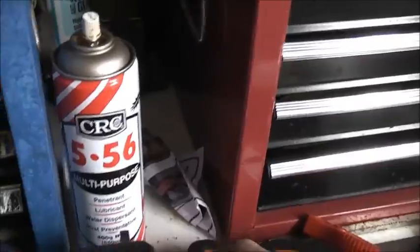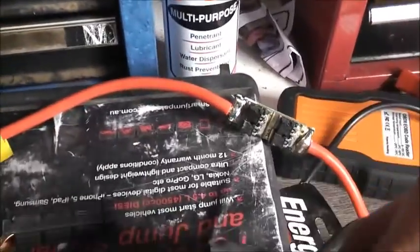The camera's playing up again. What I was saying was 300 amps is the starting current. There's protection circuitry — you can see the circuit board is all fine, nothing wrong there thankfully. This circuit board is a BMS board — Battery Management System — and that's okay too. Never stab these batteries with a screwdriver either. These are like a nuclear reactor going into meltdown if abused in any way, so do treat them carefully. I smelled something burning — it was those diodes that failed. Luckily there's protection in this unit.